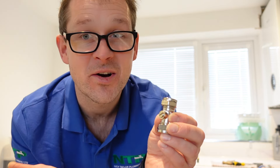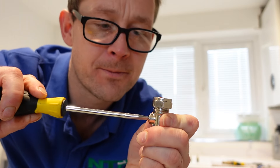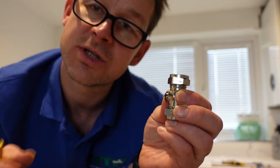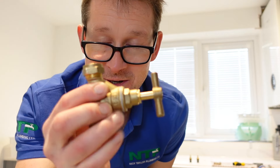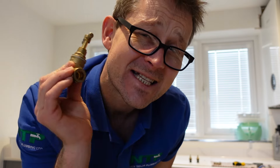If that happens you'll have a little stream of water trickle out. All you need to do is push the valve in a little bit with some pressure — not enough to break the pipework — just wiggle it and you'll find the stream turns into a little drip or may even stop. If you really are having a problem, find the stop tap and turn it off. The next problem is your stop tap might start dripping due to limescale — but that's a dead simple fix and I've got a YouTube video on how to fix that which I'll put in the comments. Thanks for watching.